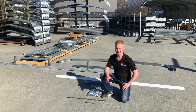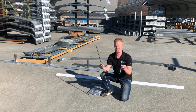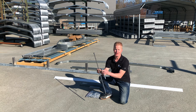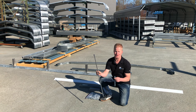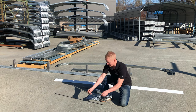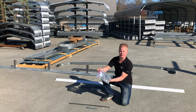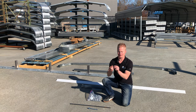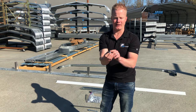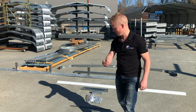We're going to go over all the parts and pieces that come with your building. You're going to have one of two items for anchoring: either a 30-inch rebar anchor for dirt, gravel, or asphalt applications, or a concrete anchor used to mount the base rail to the ground. Then you'll be given a bag of self-tapping gasketed screws. These gasketed screws have a seal to keep water out and a self-drilling head — there's no need to pre-drill whatsoever.